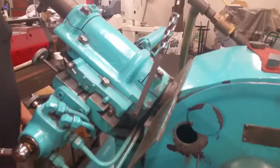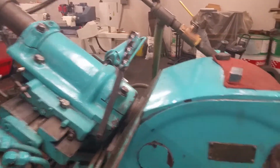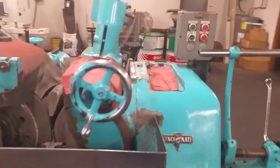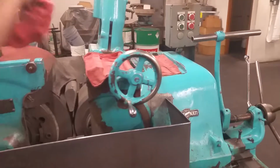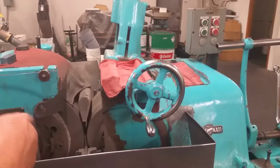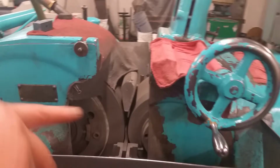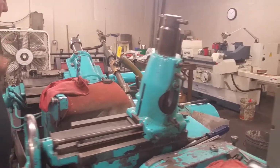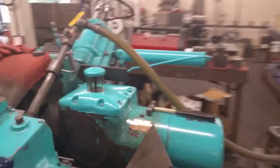Can you still get parts for this machine? Oh yeah. And then can you show me how the other controls operate? Well, that's your regulating wheel dresser. So when your regulating wheel needs truing, basically, dial this down. There's a diamond on the end of it. All these wheels are sharpened with diamonds.